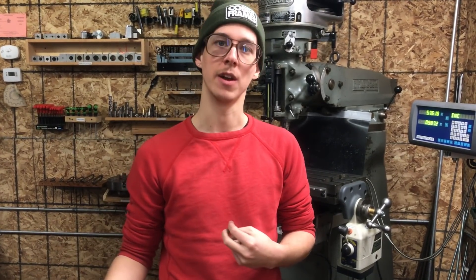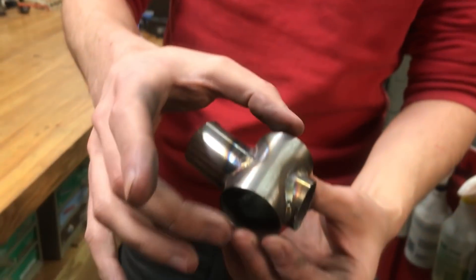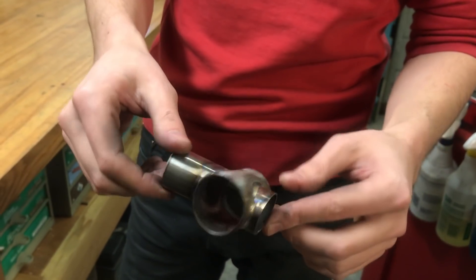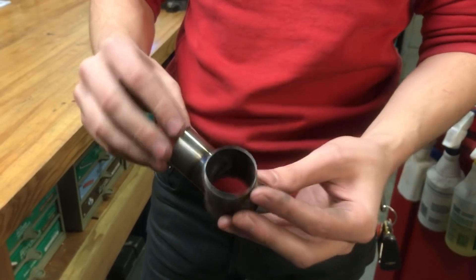Try it, get familiar with it, then put it into your bike frame. I'm talking about doing little joints like this — this is just a piece of head tube scrap and some other tubing scrap. Miter them to fit and then just test weld them up. They're not perfect, but it was really good. Every time you do it, you get a little more familiar.